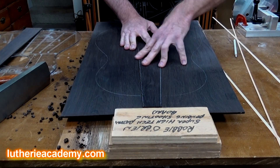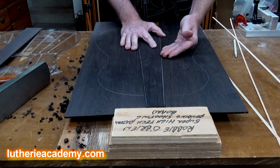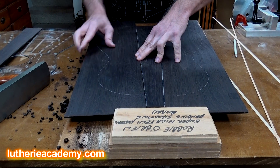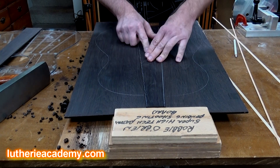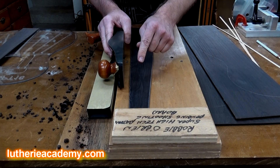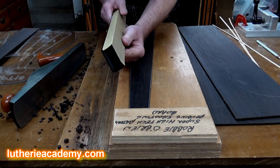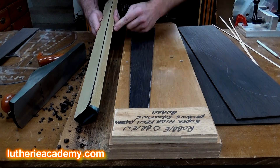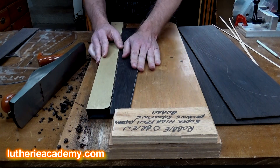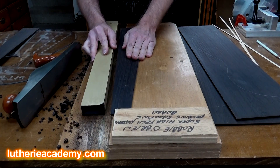Depending on whether or not you've been living right — driving the speed limit, paying your taxes on time — that goes very quick. If not, you may have to walk away and come back after a cup of coffee. But don't try to join these until all the joinery looks good. Here's a little tip: if you're having trouble with the hand plane or don't have one, I got these precision bars from LMI — they're ground flat to within just a few thousandths on each edge. Just glue some sandpaper to it and work the joint that way. It works really well for fine-tuning the joint.